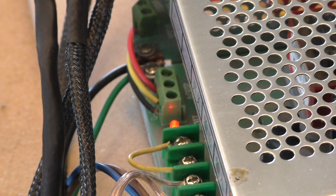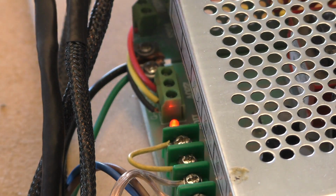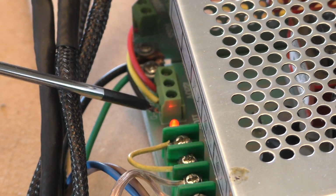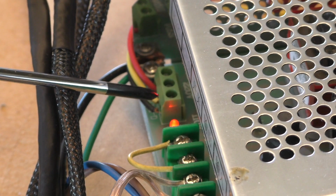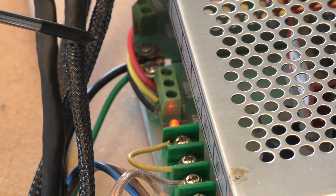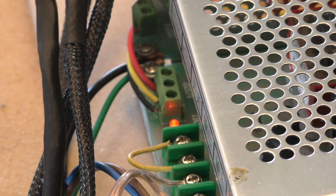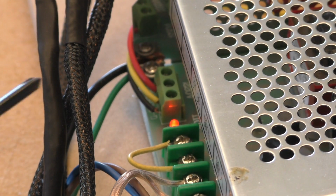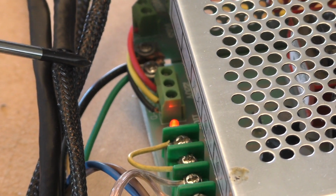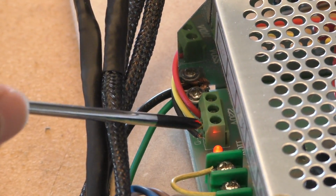It's still not fixed. Anyway, what I was going to say there before I got interrupted was that the problem in my other video where I had the fireworks was because I had connected the Arduino ground to this ground there, which is not actually a ground, it's actually 100 volts above the case, or, well, now the case is connected to earth, so it's 100 volts above earth, which is not very good. So that's why I had that problem, and now I don't have it when I'm connecting the Arduino ground to the case, which is to earth now instead of to that ground.